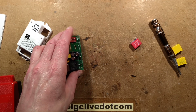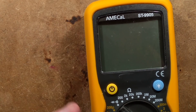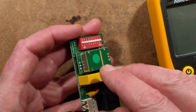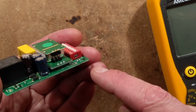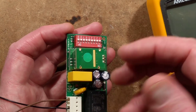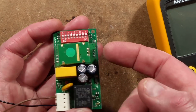Something worth mentioning about the Doppler detector: if you look at it, you'll see it's got a metal can at the back acting as a little cup so that the circuitry is screened from the back and it only sees disturbances out the front. From the fact there are three connections, the bottom circuit board will have the detector circuitry on it. The top circuit board will have the Doppler or microwave generator — that little zigzaggy antenna and the transistor inside. It just needs plus and minus power, lots of decoupling capacitors, and the signal back down to the detection circuitry.